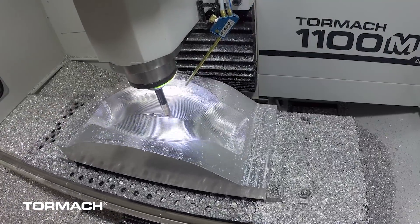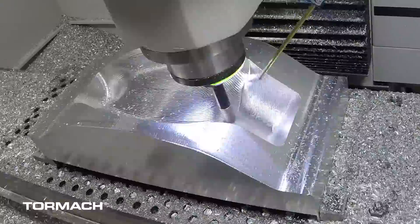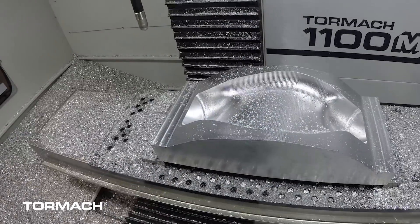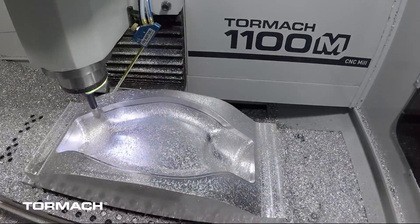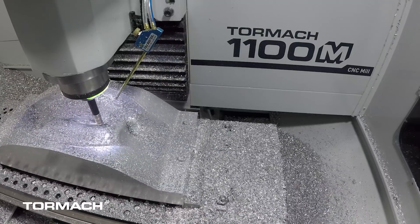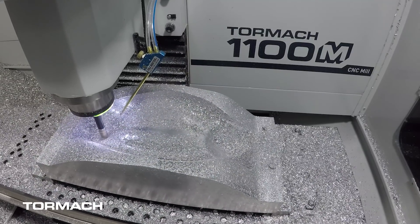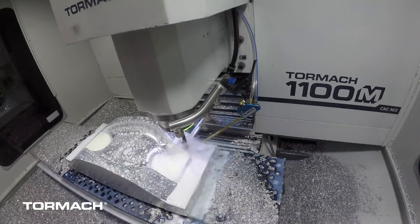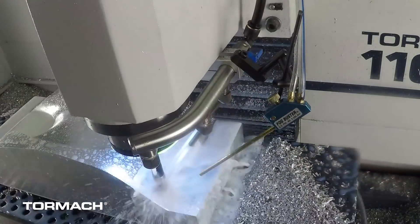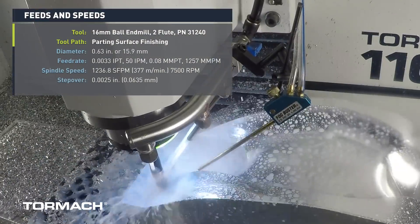I cheated a little — I ran it both ways. I left extra stock on the roughing, then semi-finished down from 50 thousandths of stock, which let me semi-finish a couple of times to see what depths of cut the machine and tool preferred for a good surface finish. When you're laying up carbon fiber, the mold surface finish is extremely important — any tooling mark or imperfection will show through in the final product. On the first semi-finishing pass I used the fog buster; it kept chips clear but I did see some recutting and galling on the surfaces, so the chips weren't being cleared effectively.